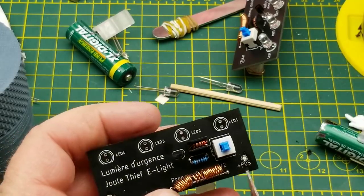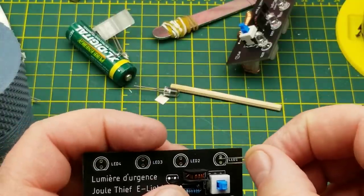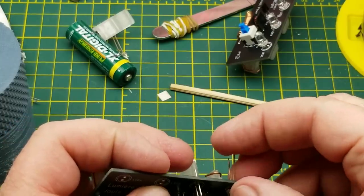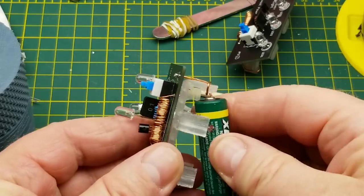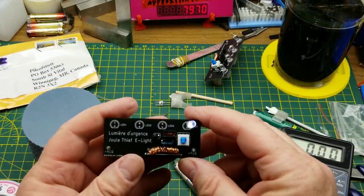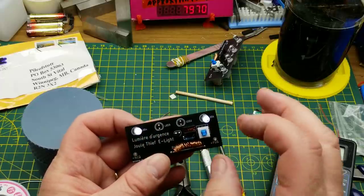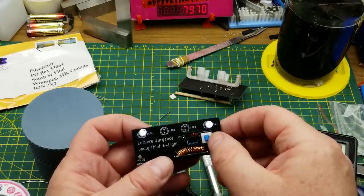Okay, there it is and it should work. I'll slide in the LEDs included in the kit but won't solder them yet — I'll put a bit of a splay on the legs so they hold electrically in the plated through-holes. I don't think I even need all four. I should be able to test with just a couple before I go to my own LEDs. Positive to that end — does it work? Tighten up that contact a little bit. There we go, it works with the LEDs that came in the kit. The switch works too.